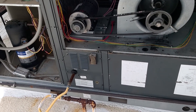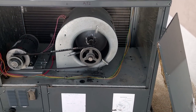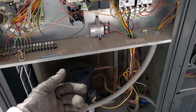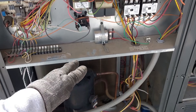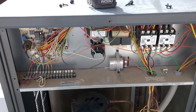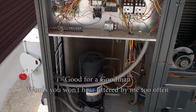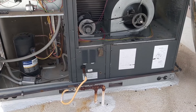There's the gas section — it's pretty Mickey Mouse to take that cover off around the pipe. I'm not doing the heating since they're still using cooling here in the valley. The one thing I do like is that they put the compressor on the outside of the coil, so when you take this cover off, it's not bypassing the coil with air and you can run it with the panel off. That's a good design element. The control setup is not too bad either — that part I won't complain about. That's actually a pretty good design.